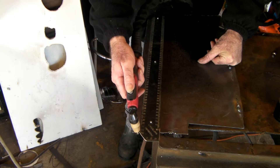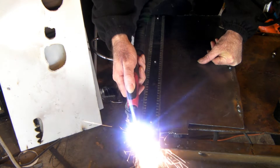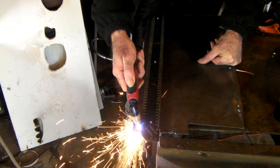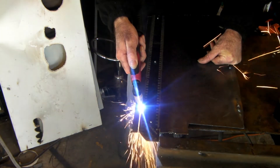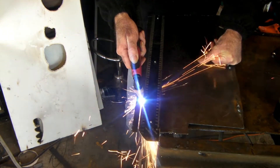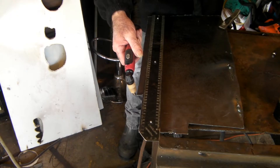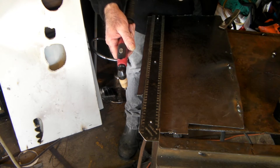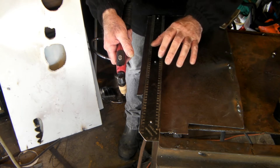Your MIG admits a lot more light than what your plasma cutter does. But now I'll do one plasma cutting and we'll see how we go with that. So now we'll just do a little bit of plasma cutting and you'll see the difference in the strength of the spark. See the difference guys? It's sort of a different looking spark. But I always thought that you never used to have to wear glasses while you were doing plasma cutting. But boy, did I get that wrong.